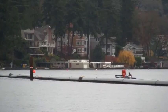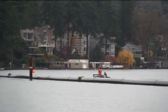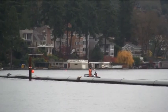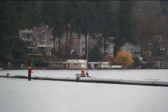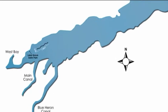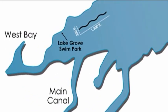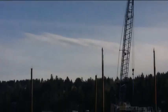The process of bending 1,200-foot pipe lengths into an S-curve demands a space of at least 300 feet by 1,200 feet on the lake. The work area must also be away from the existing interceptor and away from the areas where piles and anchors have already been installed. With these criteria in mind, an area east of the Lake Grove Swim Park was chosen for pipe bending.